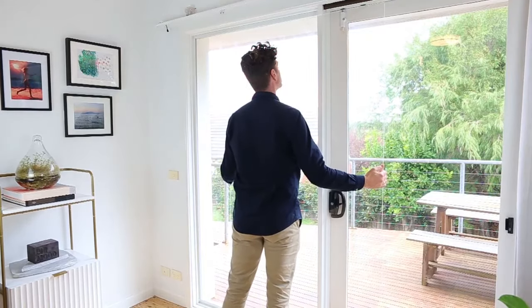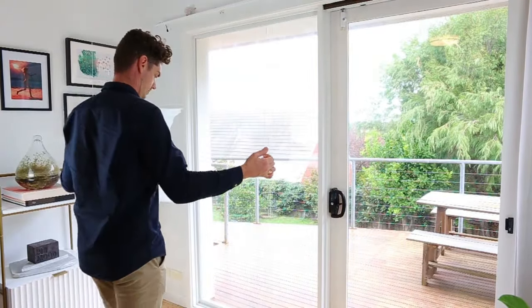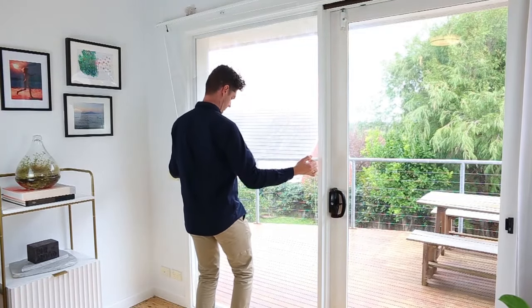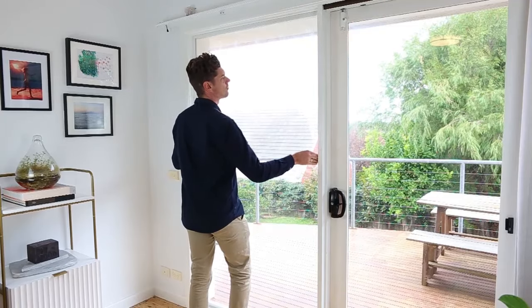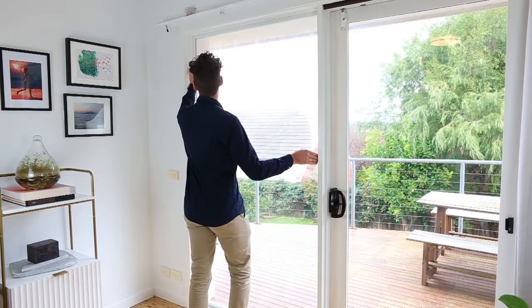I've chosen a four and a half millimetre acrylic panel as a secondary glazing material. It's ultra clear, readily available, and your local plastic sheet trader can cut this to size for you on the spot. Best of all, it's actually less thermally conductive than glass — exactly what we need to improve the thermal comfort of this home.